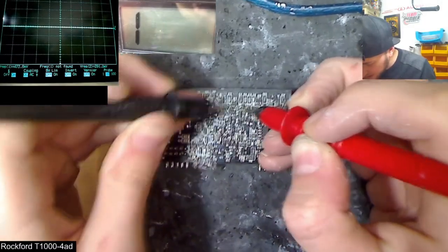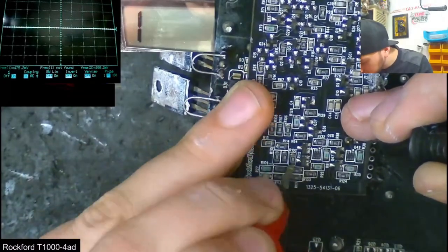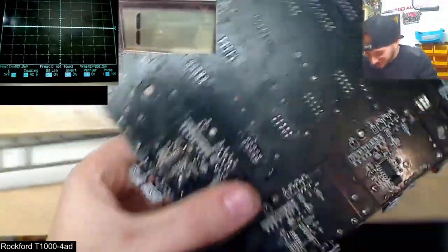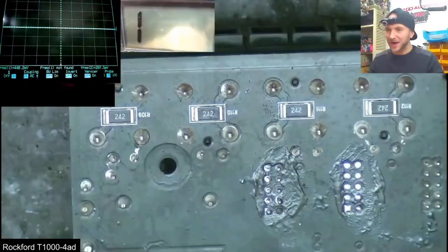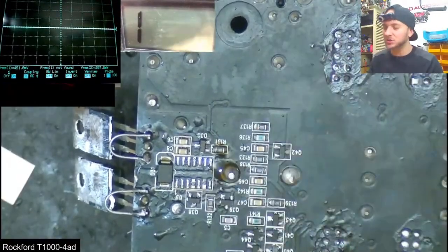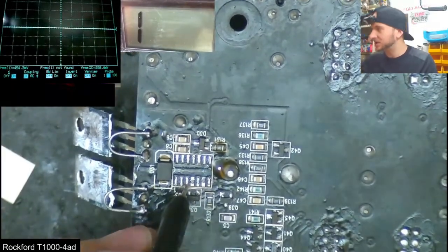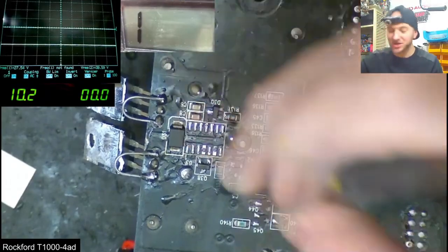While the card was out, it was a good idea to run the multimeter across all the transistors, diodes, and semiconductor parts to see if we could find any obvious shorted components. But we didn't find anything like that. And just to rule out anything on the actual main board being an issue once and for all, I decided to swap one of the good daughter boards into the bad channel location. Once I had swapped the good card into the bad channel, the correct shutdown signals now appeared — the issue is absolutely on the daughter board itself for our original bad channel.